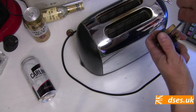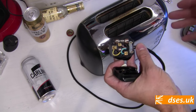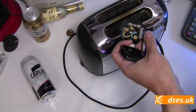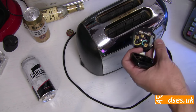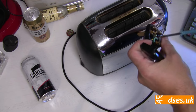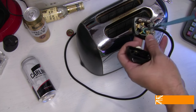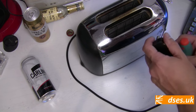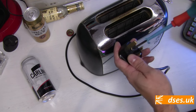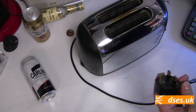For this appliance rated at 835 watts, this 5 amp fuse is appropriate. If it were a desk lamp, then a 3 amp fuse would be right for the job, while a 1500 watt heater would need a 13 amp fuse. In a lot of offices you see 5 amp or 10 amp fuses fitted in things like IEC power leads used for IT equipment, but most appliance manufacturers generally use either a 3 amp or 13 amp fuse. This plug top looks fine. The cord grip's in place, polarity is correct, everything's terminated tightly, no loose strands and fuse is appropriate and looks genuine. There's no sign of overheating, no cracks or breaks, and the line and neutral pins are sleeved as per requirements — that came into British Standard 1363 back in 1984. The visual inspection is relatively quick even with opening the plug top, but hire the cheap sticker slappers and they probably won't take the time to even peer in here.